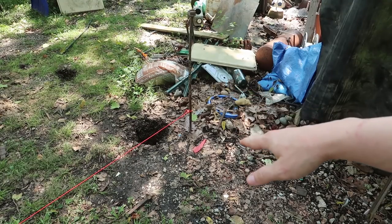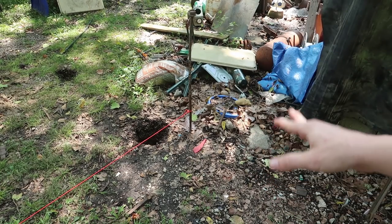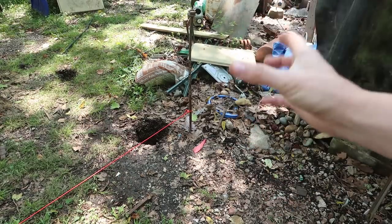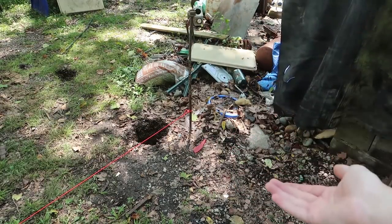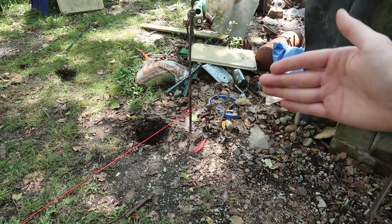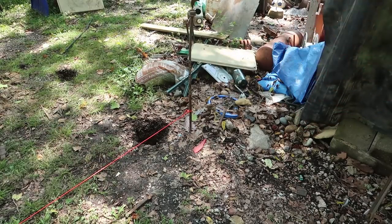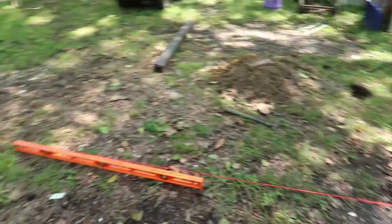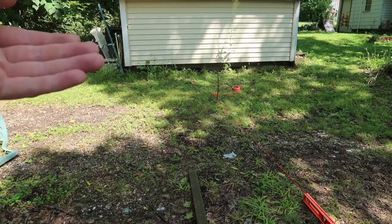The holes are going to be three and a half feet deep instead of four feet — four feet is proving a little too difficult. I'll backfill maybe five inches of rock gravel for a nice foundation for the pole to sit on, then we'll have the 16-foot pole going up from about three feet. I'm thinking I might actually make the walls 12 foot six inches tall and have a little bit of brick coming up at the base, so the metal doesn't stay wet when it rains. The water would splash against the brick instead of the metal, and with six inches of brick up, the metal would have more clearance from the ground.